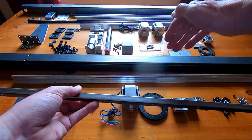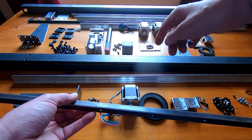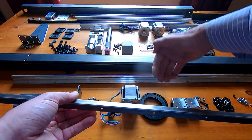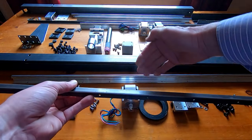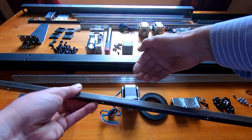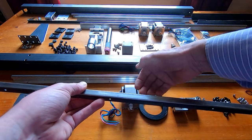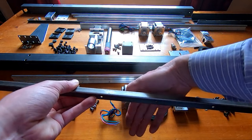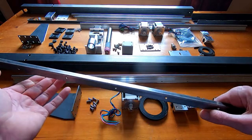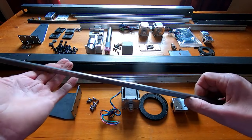The asymmetric lip design serves a second function related to debris management. Plasma cutters blow compressed air out at relatively high pressure, carrying debris down and out sideways. The idea is that the air comes up and spills around the lip, but the heavier media from the cutting process can't make that sharp turn — it hits the underside of the lip and drops back down. I've already incorporated this into my other simpler plasma machine, which is where I got the idea.